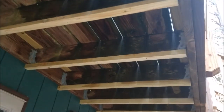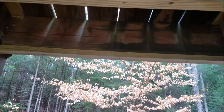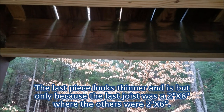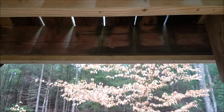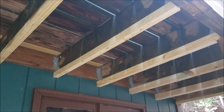I've finished all of the spacers that create the slope. The water is going to run down this way and into a gutter at the end of my deck. That last piece is shorter because there was already a longer two-by-ten or two-by-eight at the edge of the deck, so I just needed a piece to bring it down to about two and three-quarters total from top to bottom. The next step is to add the Tuftex panels, which I'll do tomorrow.